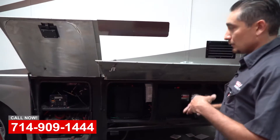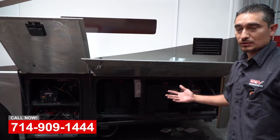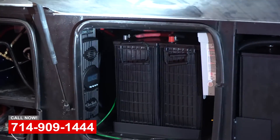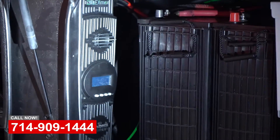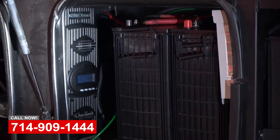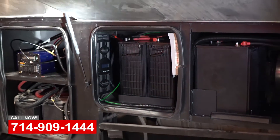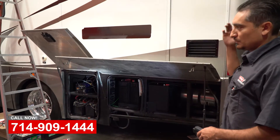The next thing was that we needed to keep those batteries charged. So what we went ahead and did is we installed a solar system — we have three 390-watt solar panels up on the roof with an 80-amp charge controller. On a good typical day, this thing is going to be charging at least 50 amps constantly.